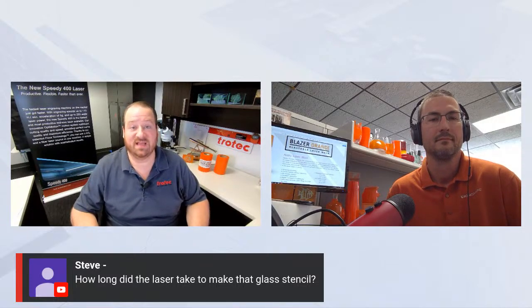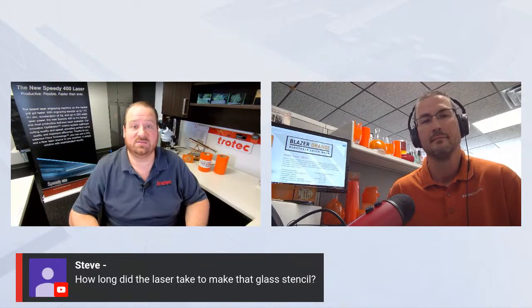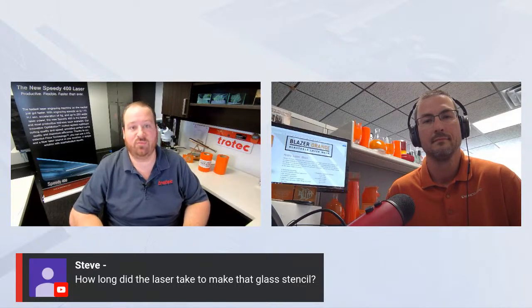Figure, depending on the size of the graphic, but that small medallion that we did on the tumbler glass that you saw in the first part of this seminar was done in about 1.5 minutes. It was a minute and a half, 1:45 seconds in that range on a Speedy 360 80-watt laser system.